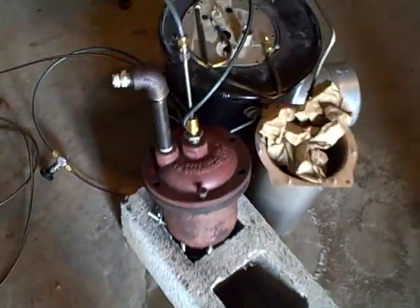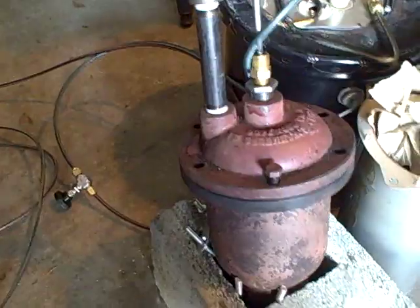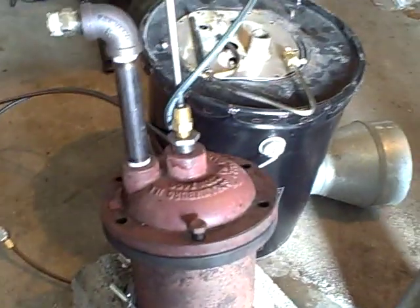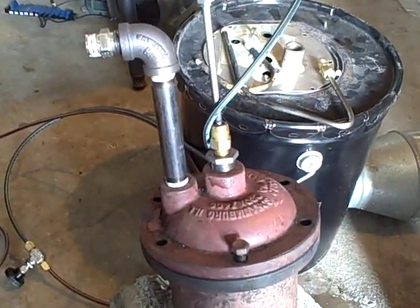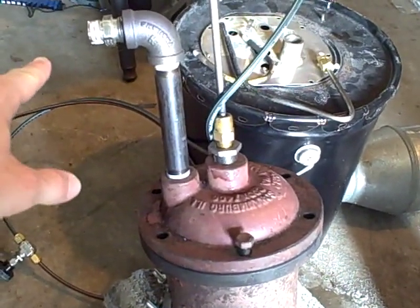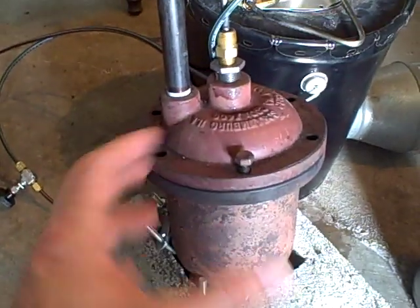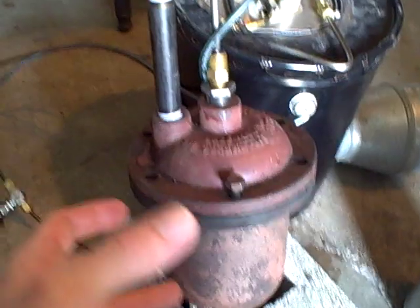August 17th, 2:43 p.m. We've got our version 3 of our gasifier sitting here cooling off. It wasn't as big of a success as I was hoping. It turned out the way it worked is we got a good stream of flammable gas coming out of here only after we had the air turned up substantially to heat up the biomass inside and make it gasify.